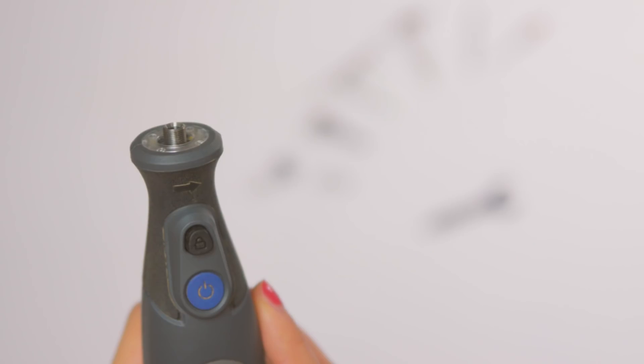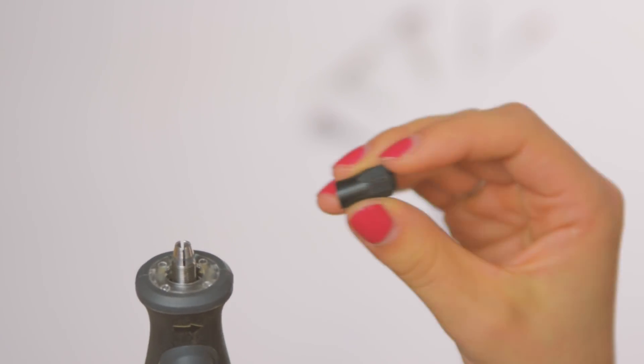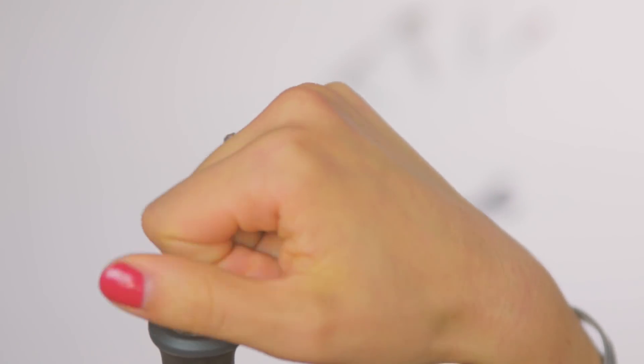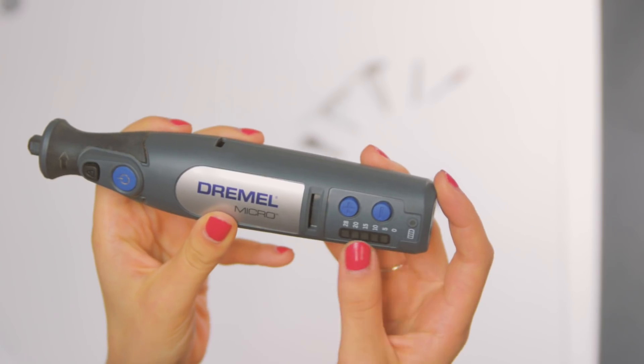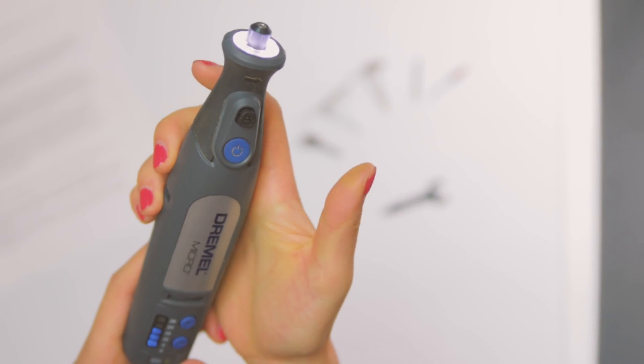Alright, let's start with the roadmap of the tool. Regardless of whichever tool you pick, there are some basic things you're going to need to know. First is the spindle — this is the part that actually spins because it's connected directly to the motor; it's usually threaded to accept the collet and the collet nut. The collet fits directly into the spindle, and then the nut screws onto the spindle around the collet to clamp the flanges down and hold your bit in securely. Next you have speed control — on your tool that could be a knob, a slider, or buttons like this one. You'll adjust the speed based on the bit you're using and the material you're working on. Finally, you have your power button — your bit should be securely held in place before you hit the power button, or else things could kinda whoosh. It's also important that you start the tool spinning before you touch your workpiece, because these things are designed to work off of momentum. Think static and kinetic friction, if that helps.